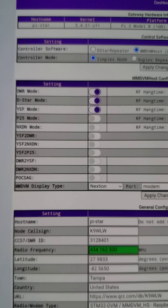Next to the configuration switches you see something called RF hang time and net hang time — those are 20-second settings and the defaults when you configure your PiStar. I'm not recommending you change those, but what I do know is whenever you hear a digital mode come through, after the last transmission ends, it'll continue to listen in that mode for 20 seconds. After 20 seconds of inactivity it will go into scan mode across all three digital modes.